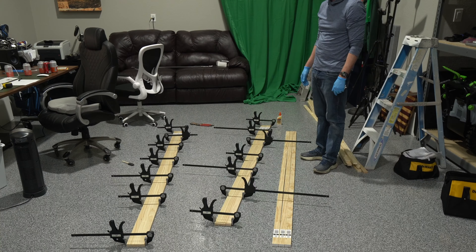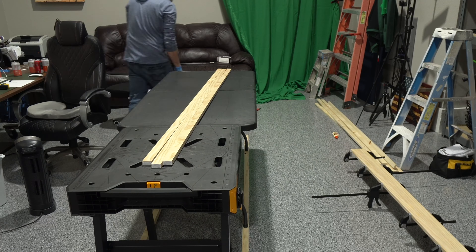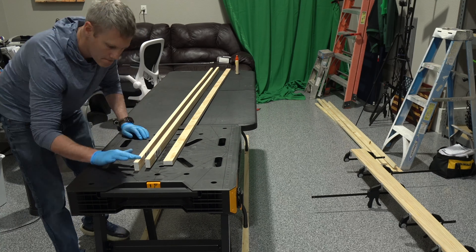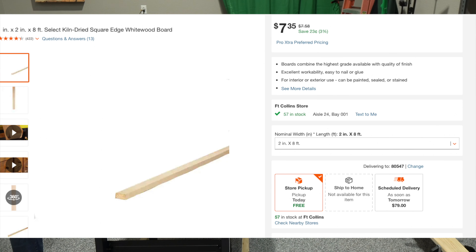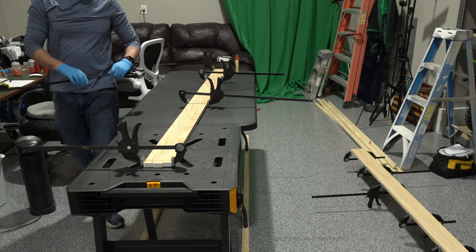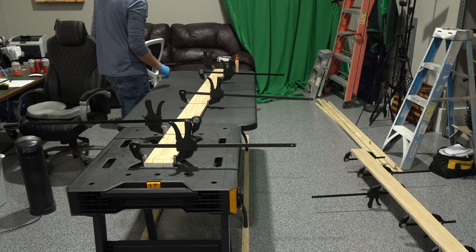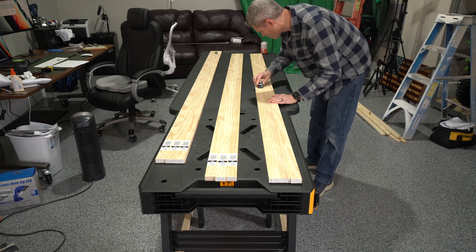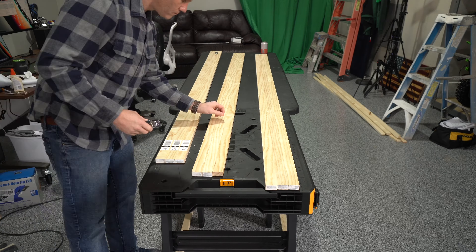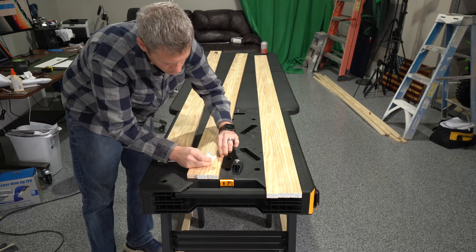I recently just sold my table saw and I don't have a track saw, so I thought the easiest way to make this would be to use a bunch of one by twos from Home Depot that were already pre-squared and dried. I bought these eight foot sections, and the reason I went with one by two is it's one and a half inch by three fourths of an inch, and if you put three one and a half inches together you get exactly four and a half inches — the width of the two foam sheets put together. I got nine of them and glued them into groups of three, then cleaned them up a bit after gluing, took off the stickers, and was ready to start making some cuts.